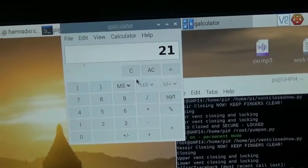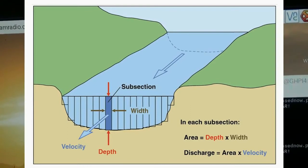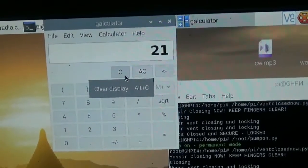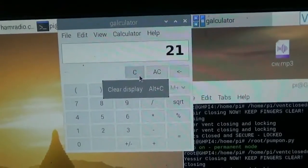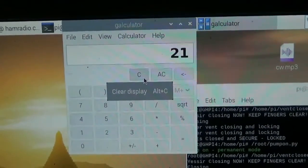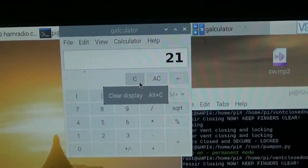I'll throw a formula up quick, and then you have your volume flow. And of course, depending on your water source, you should adjust this for the time of year. If you have dry seasons, your water flow will likely reduce. So try to design a ram pump system that will work at the minimum water flow for the season, so you have guaranteed water delivery throughout the season.